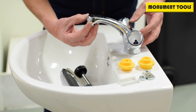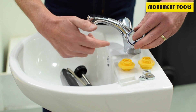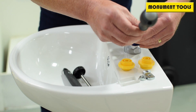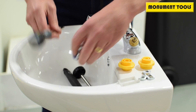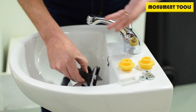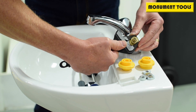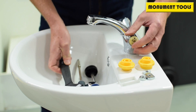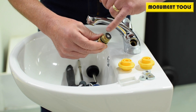There's nothing more infuriating than having a dripping tap, and it's not always necessary to replace the tap because we can reseat it. So if we strip the tap down — having turned off the water obviously, we'd be in a mess if we didn't — we can take out the jumper, and this is the washer we need to replace.